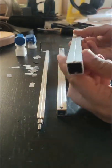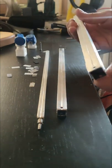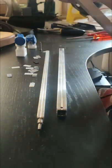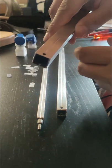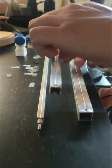You have your outer square tube. You've drilled four 3mm holes on all four sides on one end, and one through hole for M3 — generally 2.5mm — that you can then tap for the threads to go through.